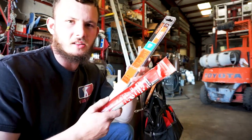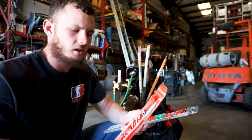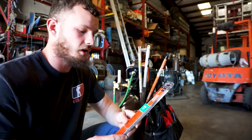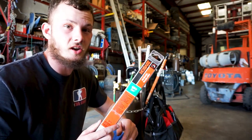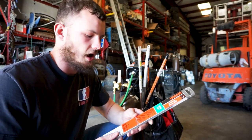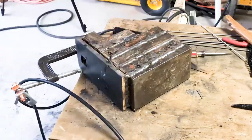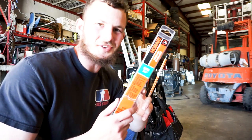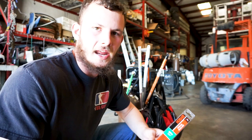The same thing applies with stick electrodes. I've run some 7018 and some thicker stuff. This is 3/32 6011 rod — a good penetrating rod. This is 5/64ths 6013 rod, more of a general purpose rod. The 5/64ths, this welder can weld all day on — just so you know. If you're running 240 volts, back down the amps quite a bit and this thing will absolutely run no problem. All of the welding pictured from the inside out was done with this 6013 5/64ths rod. It matches really well with the duty cycle and amperage of this welder.